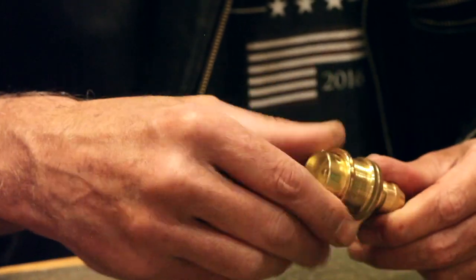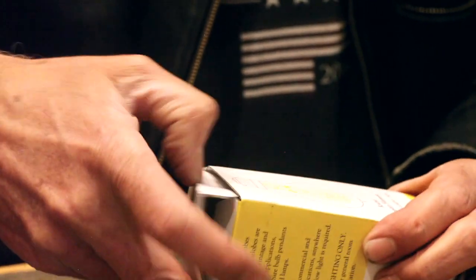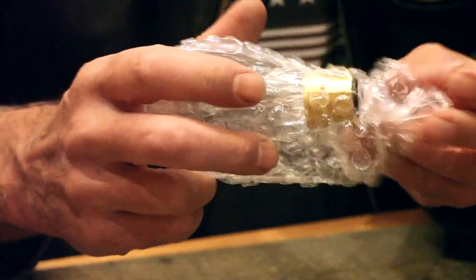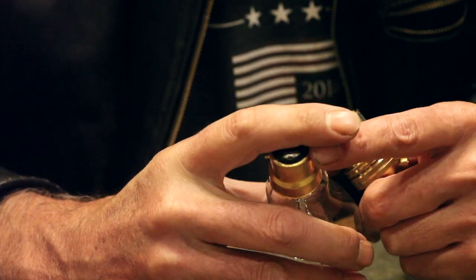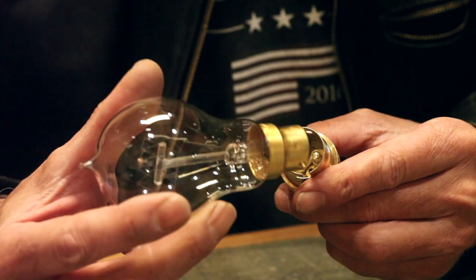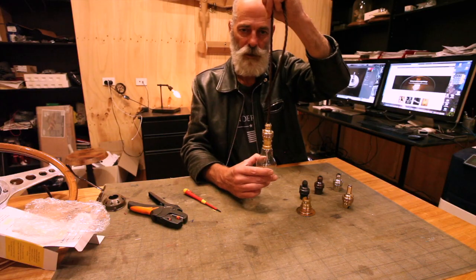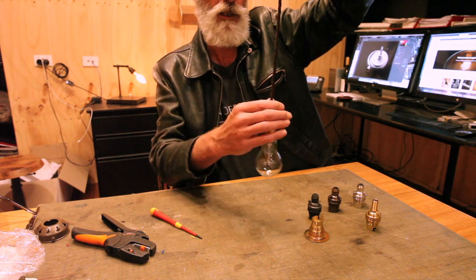All we're left to do is put a light bulb in. This is a standard bayonet globe. The two pins are the active and neutral terminals that cross here, and you'll see we've wired this correctly so the two pins on the bayonet line up with the active and neutral pins on the lamp holder. As it goes in you push against those springs and twist — and that's it. There you have it: a finished B22 bayonet 240 volt pendant, just a bare bulb pendant.